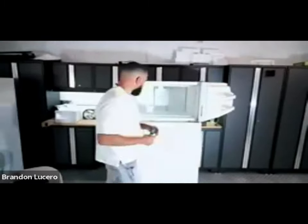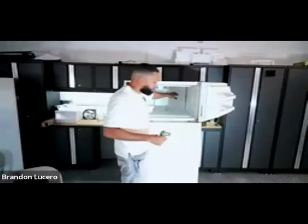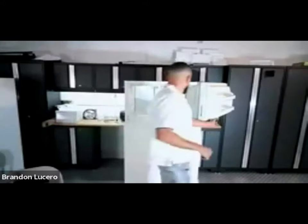I hear my fan and I don't see any frost buildup. You can always tell by just scratching - take your hands and you'll hear it. We actually have a fridge back there that has a frost problem. Another thing I like to do while I have the refrigerator in this position is look at my gaskets - am I getting a proper seal?